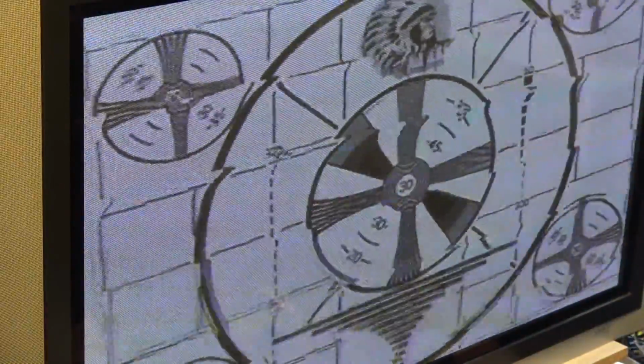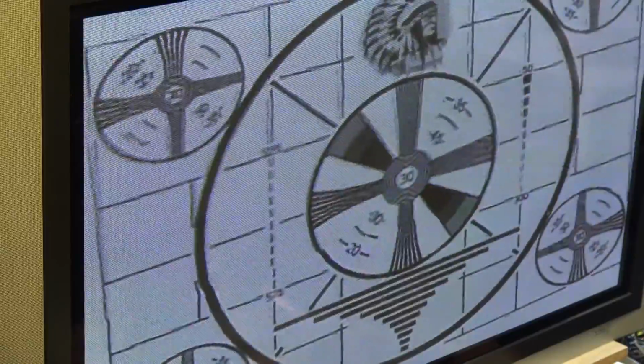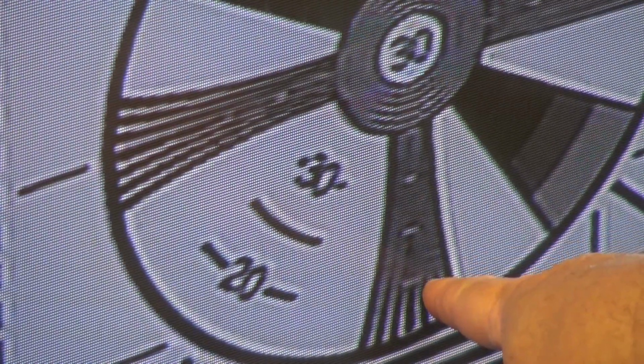If I rewind the tape a bit again here, we'll go back to the Super VHS recordings. Okay, I believe this is the, is this the standard? No, this is the Super. Let's get back to the standard and SP. So here's the SP recording again. If I zoom in here on the screen, as you can see, there's 200 lines of resolution right there, and we're not making it much beyond that, and that's the one that we're looking at in the center. The other resolution markings on the side do the same. These other ones up here show the same thing.